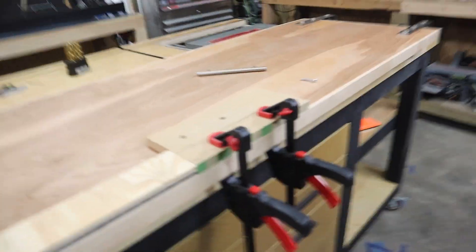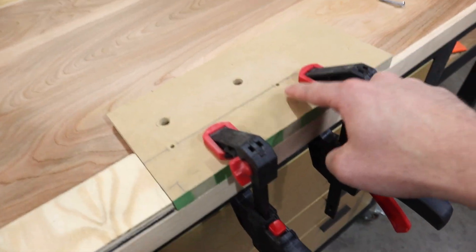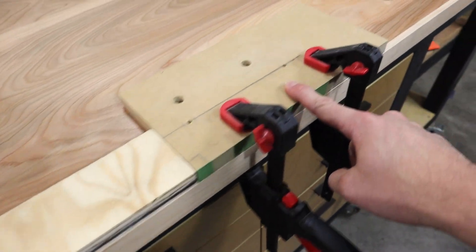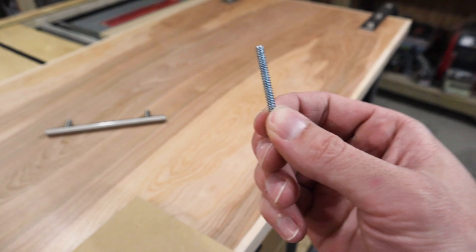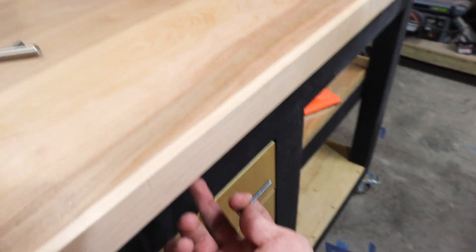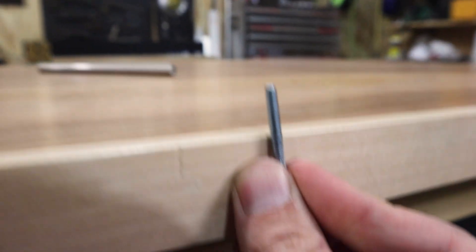It's time to put the final piece on these doors — the door handles. I've repurposed my old template for my hangers to now have holes for my door handles. I made a spacer that's 39 inches long to set the height for the door handles, and then the holes are two inches in. One thing to note is these screws for the door handles are the exact same length as the thickness of my door, which means I'm going to have to put a quarter inch bore on the backside just so they can fit all the way in and get into my handles.